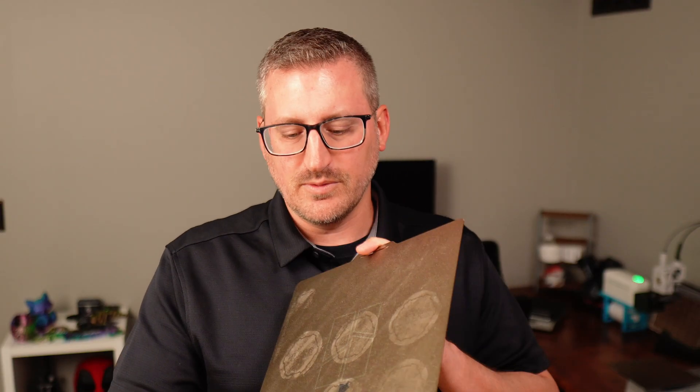I've been having a few of these every batch stick and get ruined, which kind of sucks because it's seven hours for a full plate to print. I'm probably going to try putting it on the cryo grip plate to see if that helps. Unfortunately I can't stop using Polymaker because I bought seven rolls of filament in different colors for these prints, and I have had some success with them — they've turned out really good — but they've been sticking to the plate too bad and ruining the prints. My next step is the cryo grip plate.